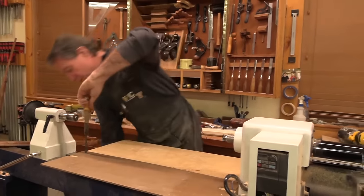Okay, that's good enough. So it's not perfect, but when you're turning a French rolling pin, that's the hard part, is to get this beautiful symmetry which you want. So it takes time. If you could turn it all by hand, obviously doing something like what I just did, you could pare it down and do it pretty rapidly. But you can also just, without thinking, quickly rough it out like this, and then you do a bunch of them, and you would head over to your duplicator setup.